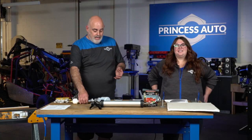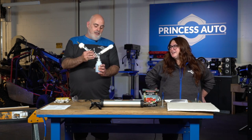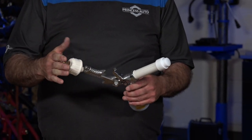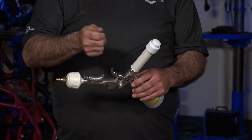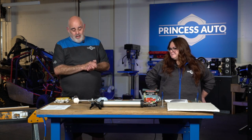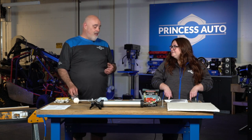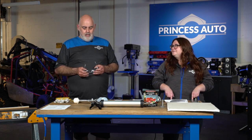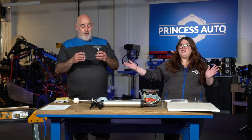For cleaning — once you're done, unscrew the cap, turn it upside down. There's going to be some powder residue in the gun, so press your hand tight over the top with the air still hooked up and force the residue out, then blow the rest off with a blow gun. Safety gear: eyewear, goggles, and a respirator in a tight environment. We've got an extraction set up in the studio here. You're looking at maybe 30 to 40 pounds of air pressure. Let's give her a go.